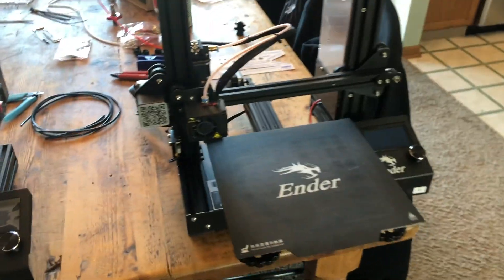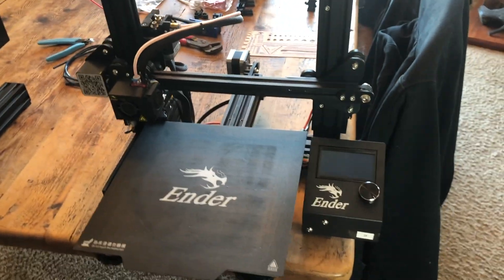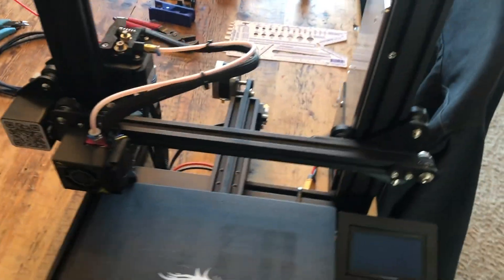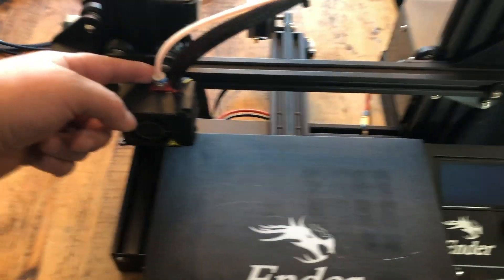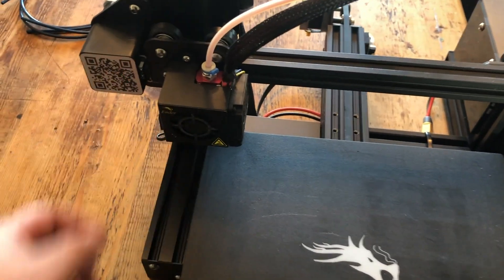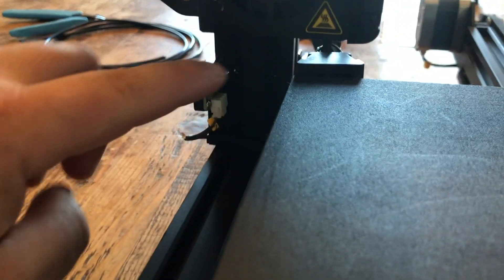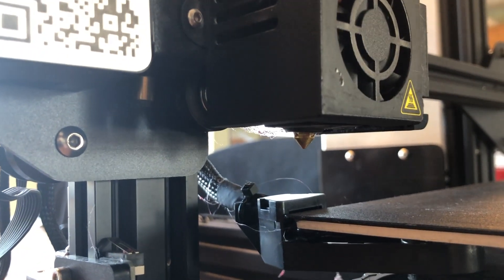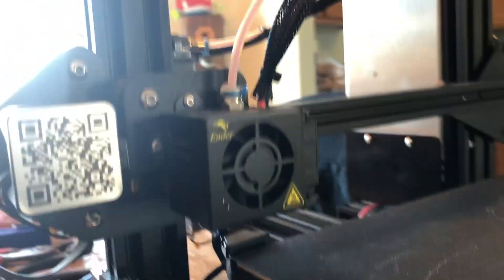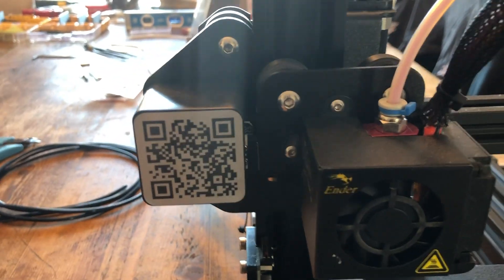I've been posting on Instagram - I don't know if any of you follow me - but I've been doing some mods to these printers. After getting used to them I don't like to mod stuff when I first build it. The first problem we had was that when our room got cold we started getting blockages in the heat break. The first one I took apart had a gap right at where the nozzle goes into the heat break, caused by a poorly cut piece of PTFE tubing.